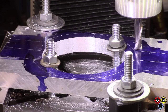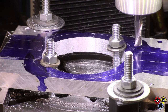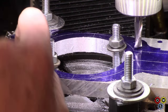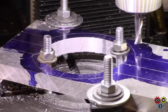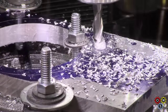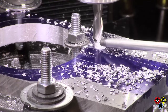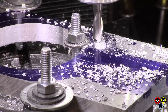What I want to do - I might just about get half inch out of it, I'm not sure. I can't get the ruler in. I'll bring the mill down just a bit. I think I'm probably going to take a plunge here and the same over here, and then go in this direction because I don't want to climb mill. I might see if I've got some shorter bolts or I might just have enough clearance. I'm leaving it a little bit clear of this corner so we can have a slight fillet when I come to finish by hand. I'm still restricting this to about 100 thou on the cut - makes it tedious but I've got to do it.